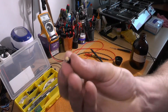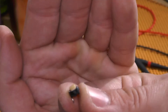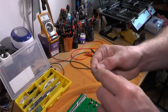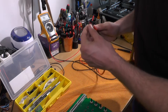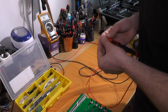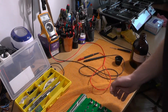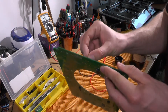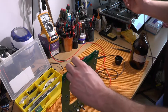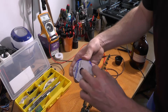I need to check the height of the switch — as you can see these two are the same size, so this one will work. I'll need to test it first just to see whether it works, because this one was removed from a VCR but should still be good enough. Yes, this one is working just fine — I'm replacing it instead of the cue button and soldering the switch back. This is quite easy to repair.